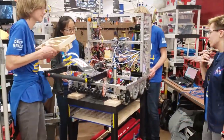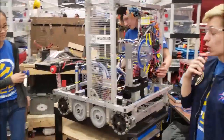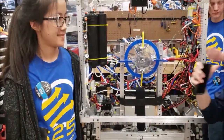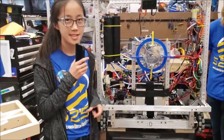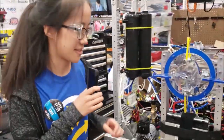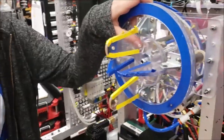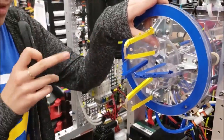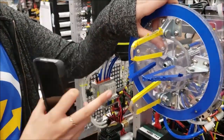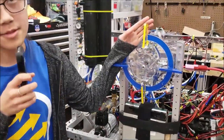Let's get a clearer view of the back of the robot and the hatch panel manipulating mechanism. Wren, can you tell us a little more about this? Yes. So this is our hatch mech, and we call it the beak because it kind of looks like a beak when it's closed. The panel goes on this — the center of the panel goes through this — and then this plunger pushes these 4 triangles open, and that holds the panel in place.